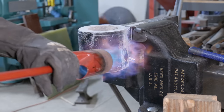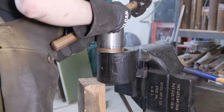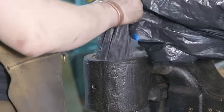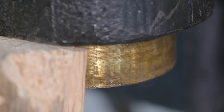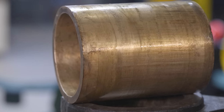With the boring bar wrapped up, we can move back to trying to get the bronze out of the pitman. It's moving — oh yeah, that was a decent amount. That is a rough surface finish. Now that we've got the old bronze out, we can get our dimensions and turn the new one from 660 bearing bronze.